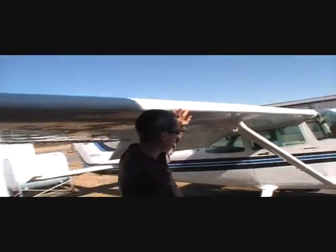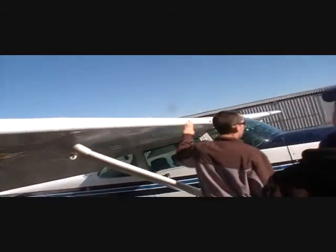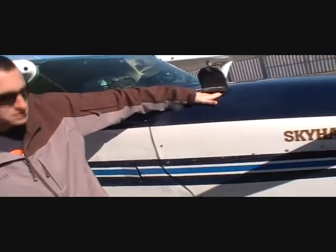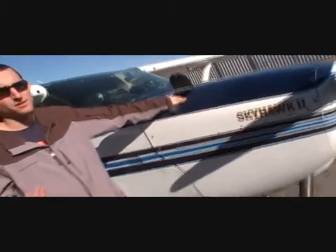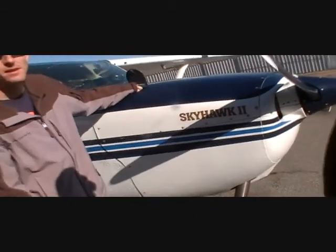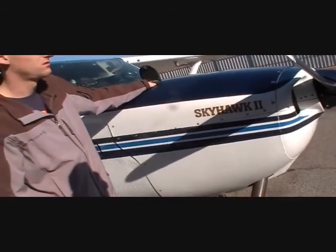Ailerons and flaps. Yep. Leading edge here looks good. It's like a 10 degree difference from the sun. Right here, there's a fuel strainer. So watch your toes. You pull up just for a second to drain a little bit of fuel off. If there's any water in there, any water will come out. Wow, okay. I really don't try and do a monkey circus dance and catch it while I'm draining.